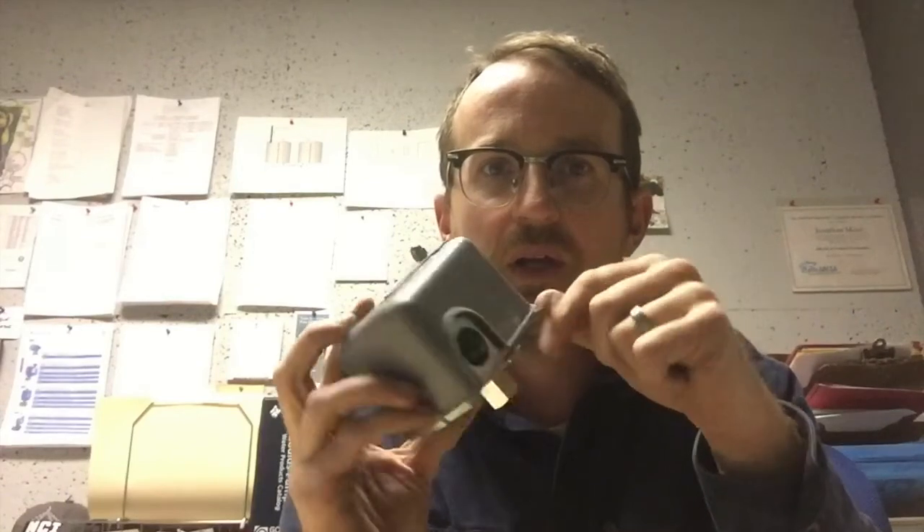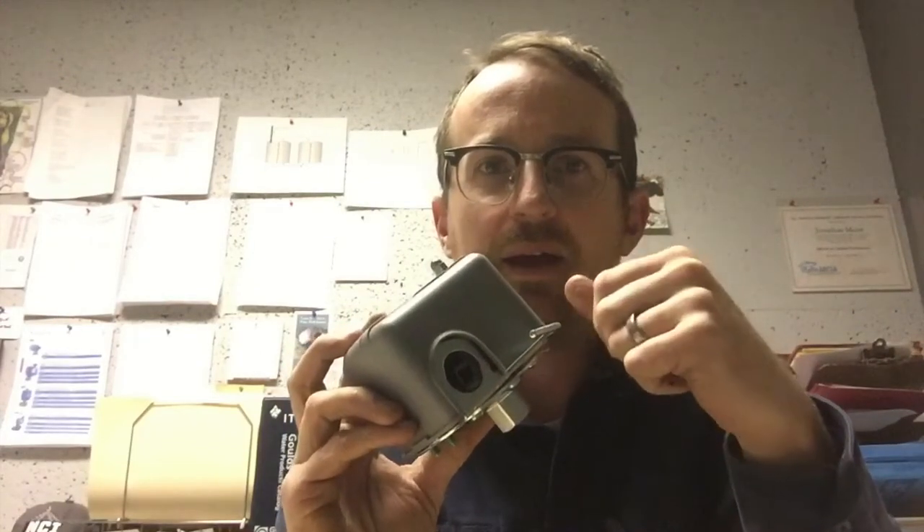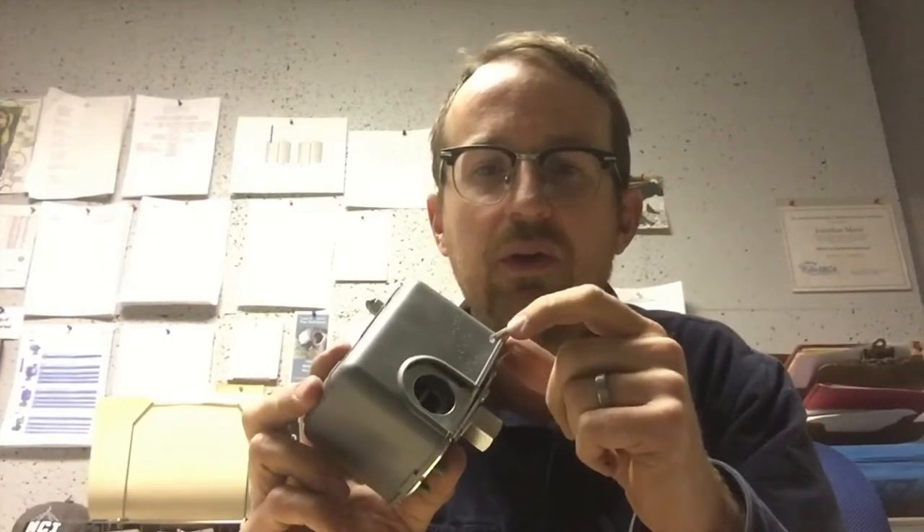Hi everyone, Jonathan from Rainbrothers here, rainbrothers.com. We've had a few customers over the years who have reported problems. They'll call in and say they have a jet pump in their basement or crawl space and they have this type of pressure switch with a low-level cutoff lever here. They'll report that they're using an appliance, taking a shower, doing something, and this low-level cutoff will activate and shut down the pump and they have to go restart it every time. If that happens, it's usually caused by a surge in water usage inside the house.